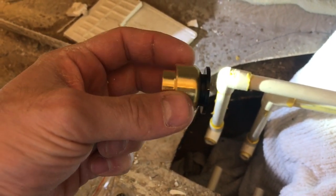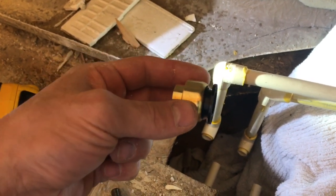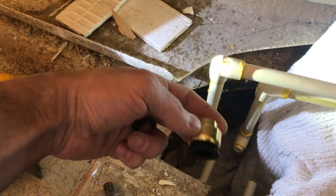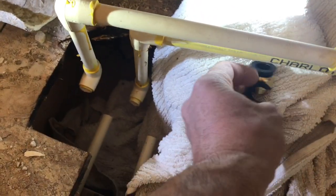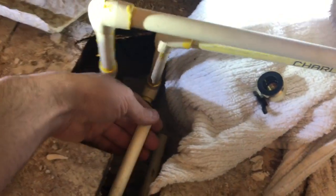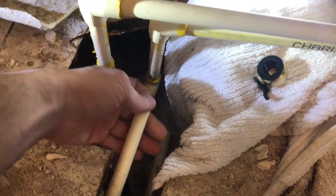You need to make sure that as it slides all the way on, you've got about three-quarters of an inch of copper or brass fitting that is going to slide directly onto the PEX piping. It's as simple as that — you cut it, and you can sand around the pipe. I used my nail to clean it up inside and out.